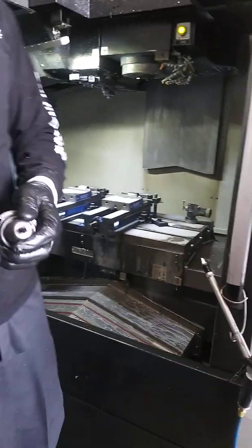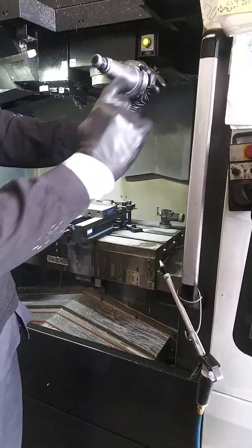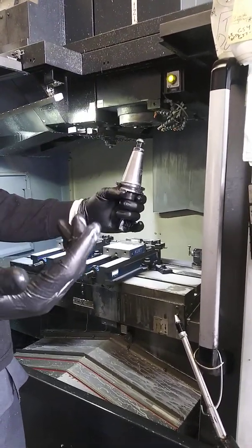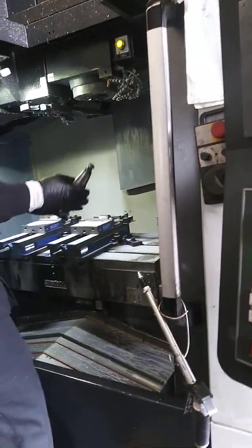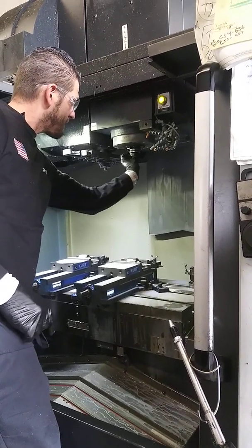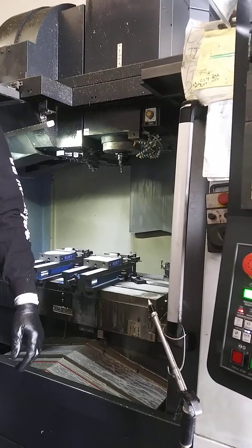So now I'm changing my tool out. Got it on, put a grind on it, take this one out, whatever we gotta do. Put it in here. Now this machine is very careful about what these two look like. This one is like this - the bigger opening towards me. The other one, bigger opening towards the machine. Knowing your machine. If you don't know, pop your head in here and you'll see. You can just clearly look at it. If I do it backwards, see I'm gonna grab this small one - I put it over to me and watch where it doesn't go. See how it doesn't go in there? If I spin it around, see how it went up in there? So it's really important.